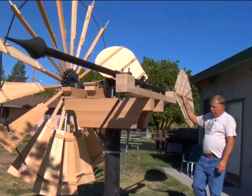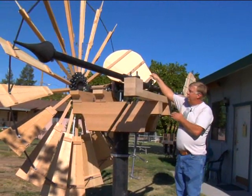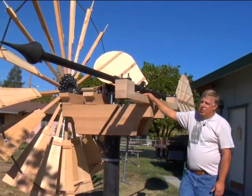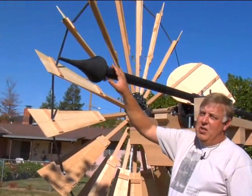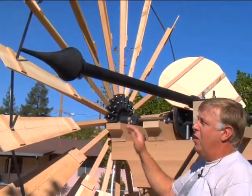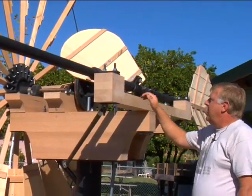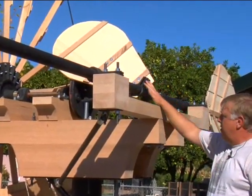As we come down the tail, we see this furling vane. There's a counterbalance linkage that'll go on right here and we'll work our way down. A unique decorative piece they had on this windmill was this decorative spear down here, which actually served as a counterbalance weight. So it made everything level. That's one of the fun parts about this — looking at the old photographs, figuring out how they did things and why they did it. It's a very unique style windmill. All of these have grease points on them where you'd have to actually go up the tower and grease these as it goes around.